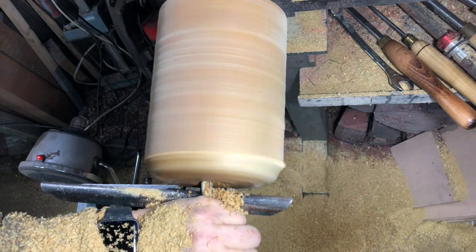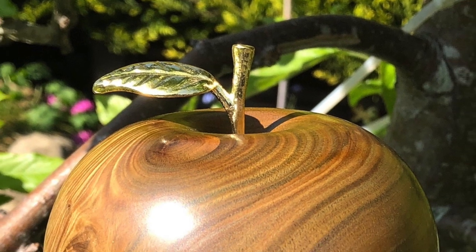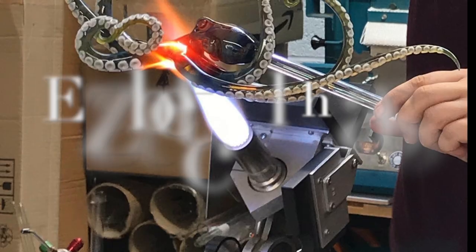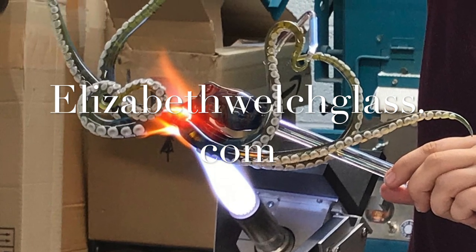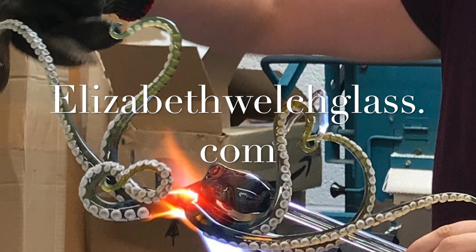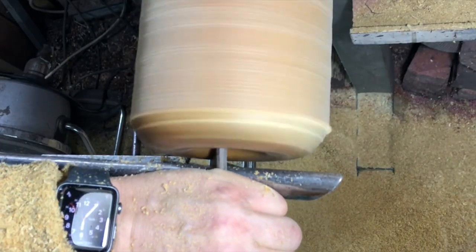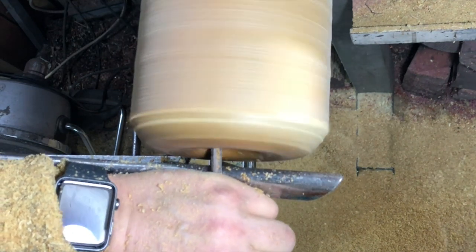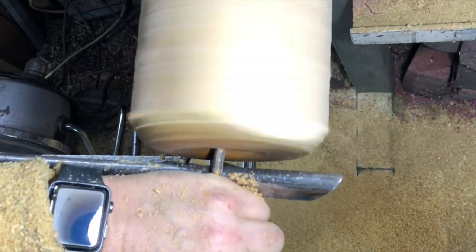On the previous apples I made out of the same wood - lignum vitae - the very first one had one of those stems you can buy from woodworking supply shops with a little leaf on it, very pretty, gold coloured. The second one I did was for a glassmaking friend of mine who wanted a hole in the side of it and was going to make a glass stem, so I just drilled the appropriate holes for a worm coming out the side of the apple, and she's going to have a glass stem and leaf that she can make. Amazing skills. If you look at apples, they go quite a long way down and the angle gets quite steep. Get this bit wrong and it just looks like a half-hearted attempt at an apple.